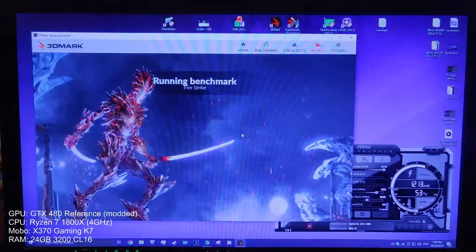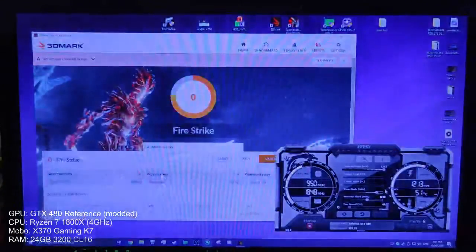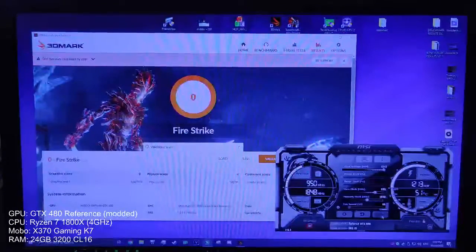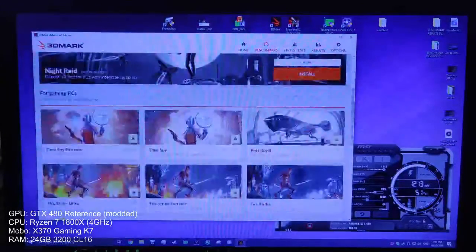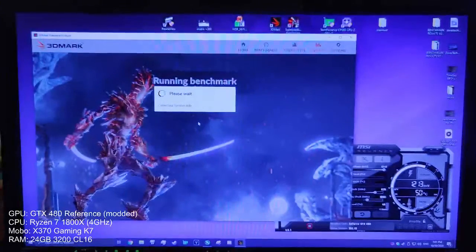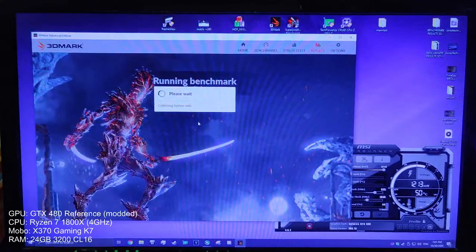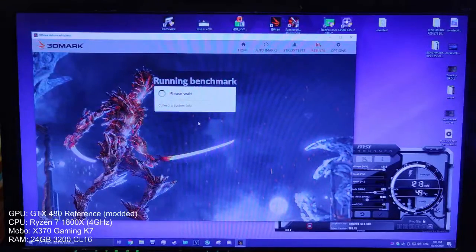So, this is not gonna run 950. 925? Just kind of dialed in. I'm actually more interested in what the memory will do, because I have a rough idea of what the core was doing, though it's still running faster than I thought. Like at 900 megahertz at stock volts, that's pretty impressive.